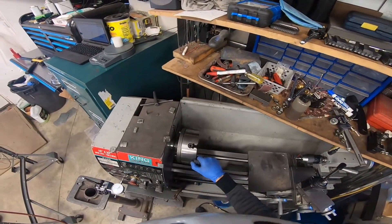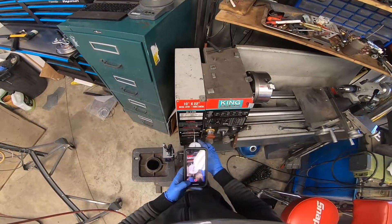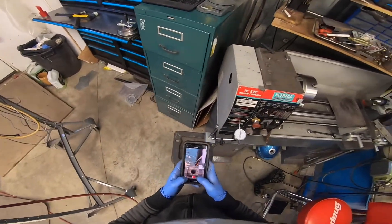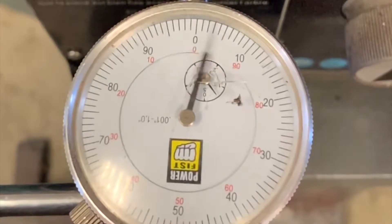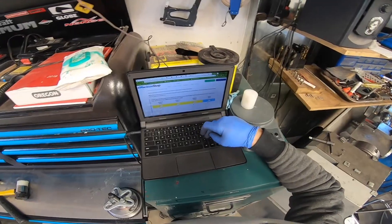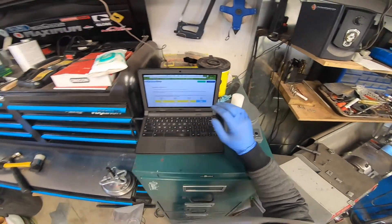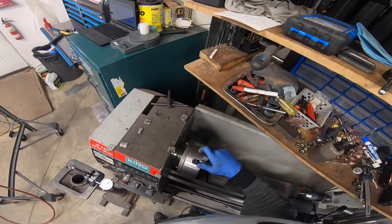We take our magnets, move them from A to B, and repeat the process. It doesn't matter if the needle's on zero — all we're looking for is the sweep of the needle, how far it moves. I generally record for three seconds. Looking at the movement of the needle in position B, we can see it goes from about 9 thousandths to 7.5. So 9 and 7.5 is 16.5. We click the balance button again, and now it tells us to put the five weights in pocket three.